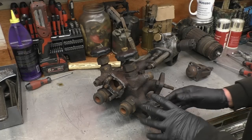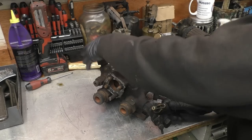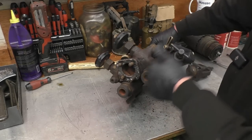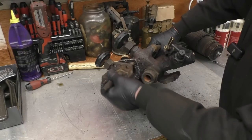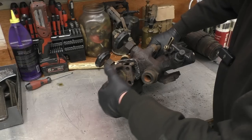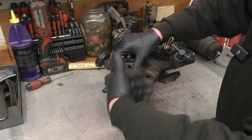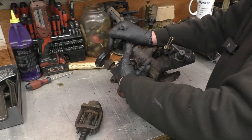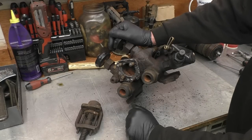This part here is a lubricator that mixes oil with the steam. These are valves for various purposes. We'll go into them a little bit later. On top of here goes this little piece here, which has a handwheel on it, or a handle, and you turn that, it's a left hand thread, and it pushes down and pushes that valve completely closed, so it totally seals off and locks off the engine.